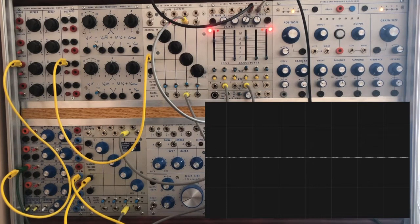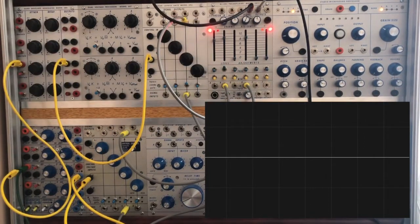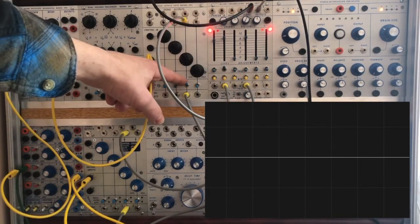Maybe a little bit of an increase in volume, and that's usually because you're sort of combining the gate with the low pass filter, and so there's a little bit of summing going on there, and so you'd think that the signal will naturally get a little louder. Now, I don't know if that was a design choice for the C, an improvement of sorts, that the volumes are better matched, but that's one way of looking at it. And then so we listen to the B in filter mode, and then let's go back to the low pass gate mode.